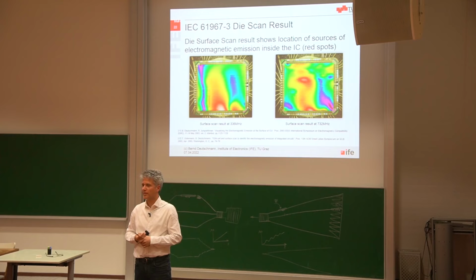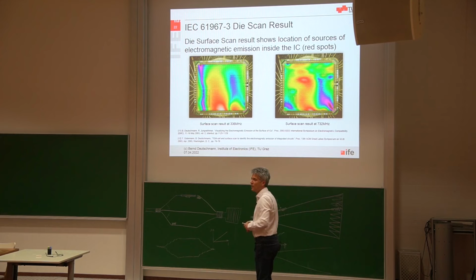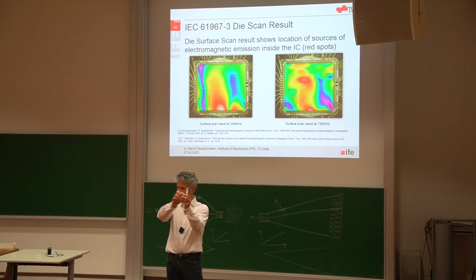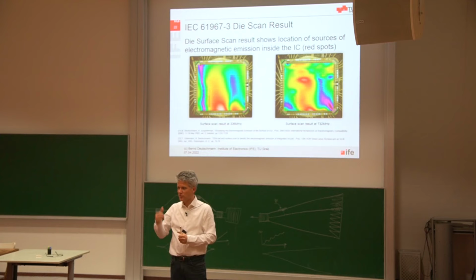But with this information, it was not that complicated because we were going to the layouter and told the layouter, hey, check, there must be something here which is responsible for the generation of quite a lot of magnetic field. So please take a look in your layout what's here. And then we were checking the layout and it was not that complicated finding it. Because in the digital part, there are usually rows. There is VDD and VSS, and between the rows, there are all the digital components, like inverters, AND, NOR, or whatever gates. And unfortunately, here in this area, the extraction tool, which was extracting the clock tree,